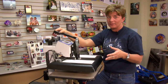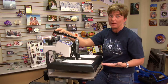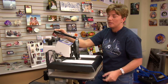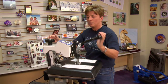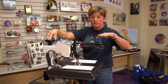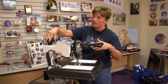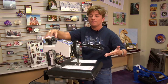We're going to talk about pressure, and what that consists of is the gap from the lower platen to the upper platen. My recommendation for adjusting resistance, or pressure, which is the gap, is to start with a cold press, lower the handle, turn the knob until you see this lever — it'll start to drop. Remember: lefty loosey, righty tighty. So if you turn to the left, the lever will start to drop.